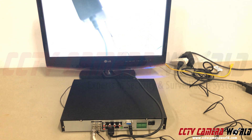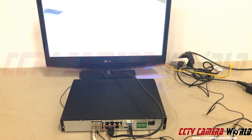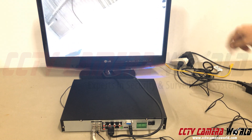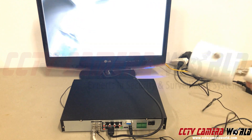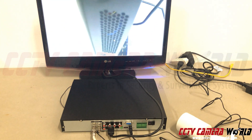If a camera doesn't give you any video, same process: dismount the camera, get this trusty power supply plugged into your outlet, get yourself a short cable, and do this test. First make sure your power is good. Second, your cable is good. Third, your camera is good. Once they're all good, everything will be working fine. I hope you found this video useful. If you have any other questions, feel free to email us. Thanks for watching.